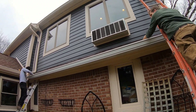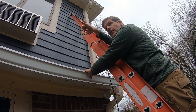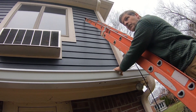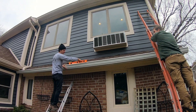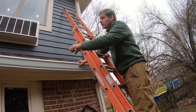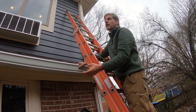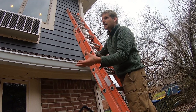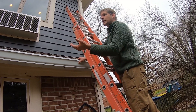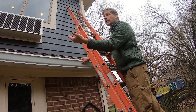We can put one screw and then feed it up the drip edge or down the drip edge, however it's going to work. We're checking level - we just want to make sure that end is higher than this end because this is where our downspout is. It doesn't have to be super exaggerated, just downhill. Part of the problem with the last gutter is there was a sag in the middle, and probably with all the leaves gathered in there and it being heavy, it helped distort the gutter pretty badly. So now we're trying to make sure this is continually downhill, tucking the back edge of the gutter under the drip edge as far as we can and keeping that downhill slope.